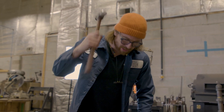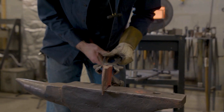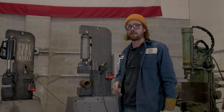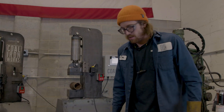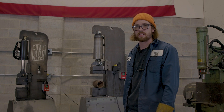Right now I'm just trying to pull material down from the blade to make the beard a little bit bigger. One cool thing you can do with the presses is use top tooling and bottom tooling — just tap it to make the top flat. It's kind of sketchy so just be careful when doing it; use common sense.